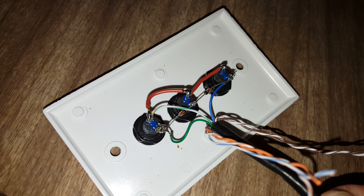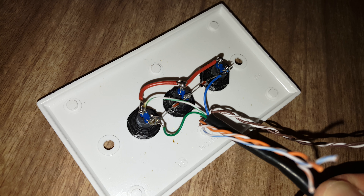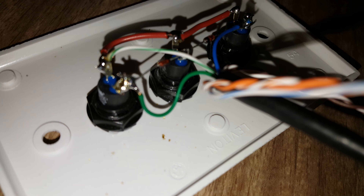The white and green is the common lead on all three. Then you have green going to one button, blue to the other, and the two diodes pointing in with the bands facing the inside.